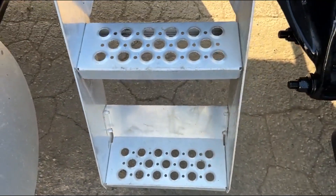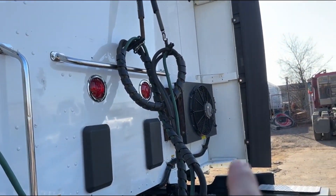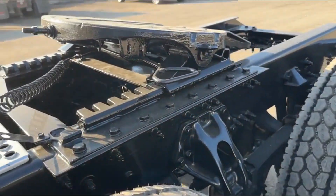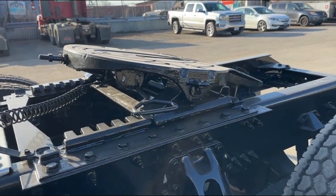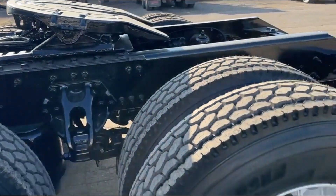You've got a step up here to go on the back of the cab, so that's great. Your condenser unit for your APU is right there. We've got brand new tires — 11R22.5s. Looks like a recently rebuilt fifth wheel — it's a Holland 3500 with about a foot of movement forward to back. It's currently set right at the middle of the drives.